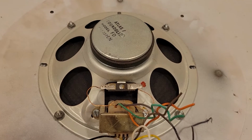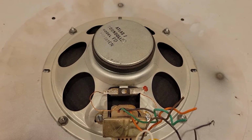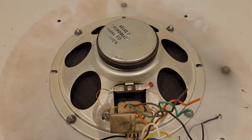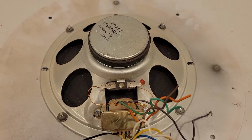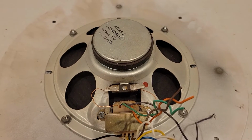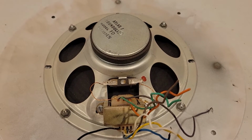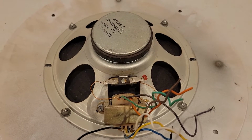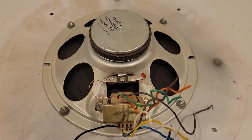But the thing that makes the difference when that voltage is so low is that impedance has to be watched real carefully. And impedance is measured in ohms, or resistance. Most speakers will be 8, 6, maybe 4. Sometimes with subwoofers, especially in car systems, you might be talking a couple ohms. But if you try and connect 2 speakers together, their resistance doesn't stay the same.